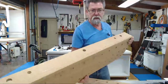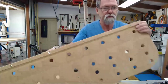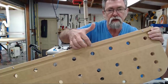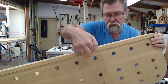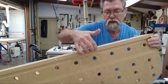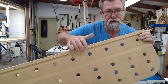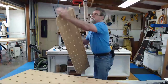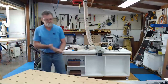Now clean that, but you can see that the screws are where the cushion strip is going to go. So when this is dry, I'll undo those screws, drill a hole down the middle for a quarter inch dowel to go in, and then give it a quick shave, and then the cushion strip will go over the top of it. This one here is the rebate for the T-track. Okay, so I'm going to sit that to the side. It's going to live there.